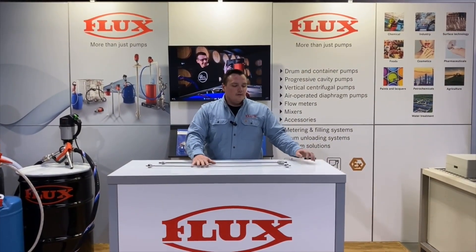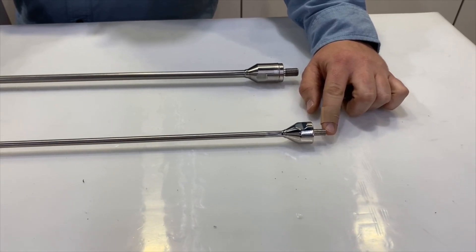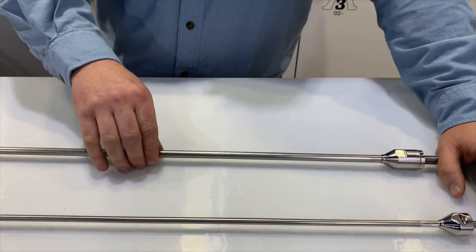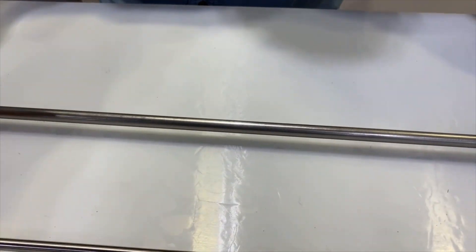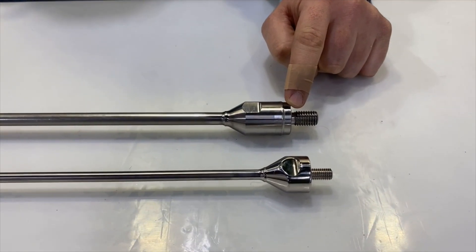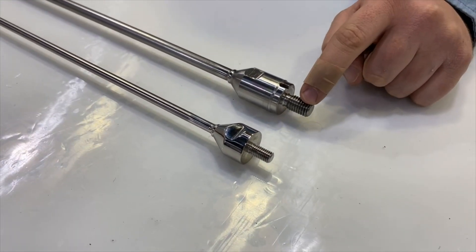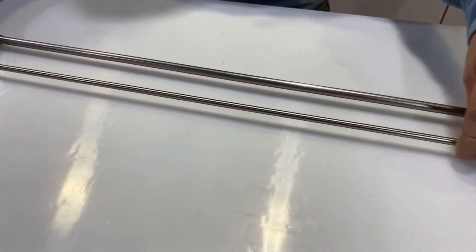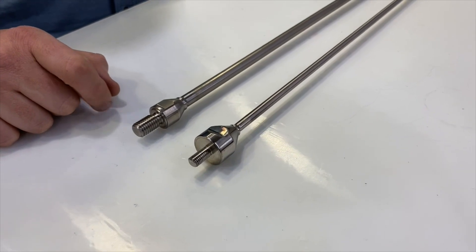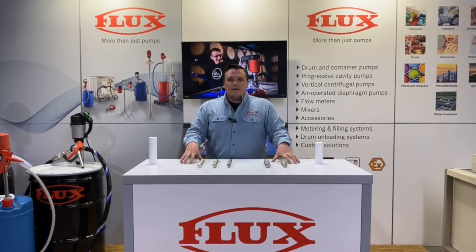Now we will compare the pump shafts. The shaft for the F560 is threaded at the top to go into the gearbox, and this is a 7-millimeter pump shaft. For the Visco Power, we have upped that to 10 millimeters — you can see the difference in diameter. Up top is the notch for the seal alignment of the stationary face and the shoulder which holds the seal in place as it threads into the gearbox shaft. On the rotor-connection side, both the 560 and the Visco Power shaft thread into the rotor, but the Visco Power has a much beefier, stronger thread.